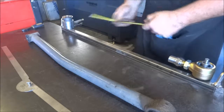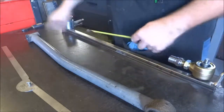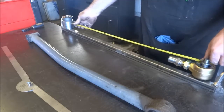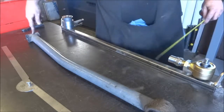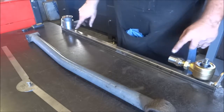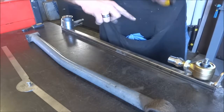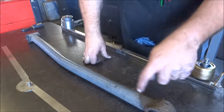From this bushing to there I need a piece 28 inches long. Because this end has a threaded bung, the tube is actually about 30 and a half inches to the weld points. For the other piece, I need 28 inches, with the center of the bend at about 14 and a half inches from the axle end. I'll put it in the bender, bend 10 degrees, set it in the fixture, tack it, and finish weld it. This thread bung has a chamfer, so I'll put a chamfer on the tube too so the two chamfers mate, then weld the inside.